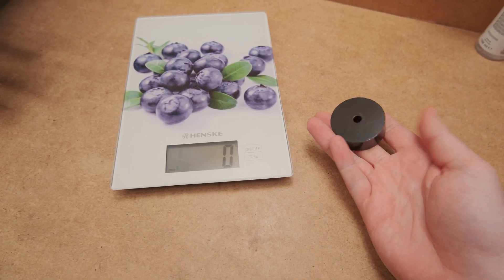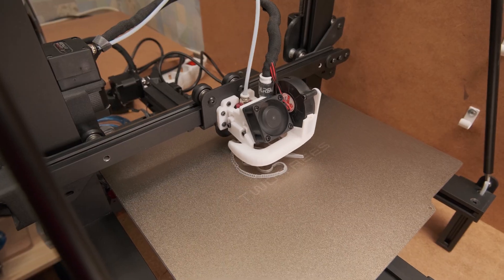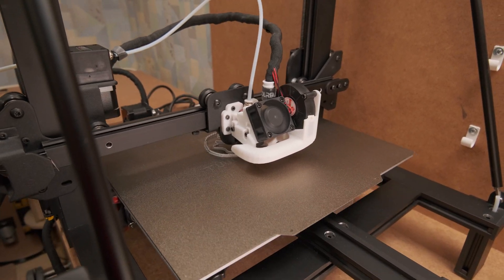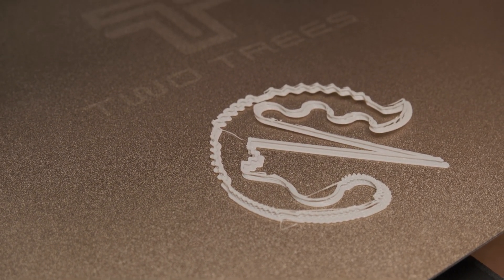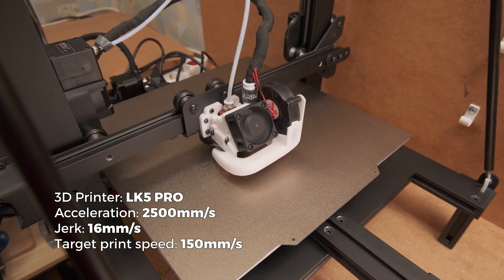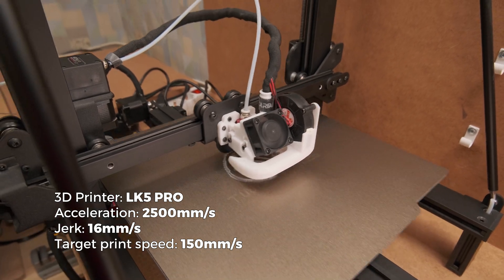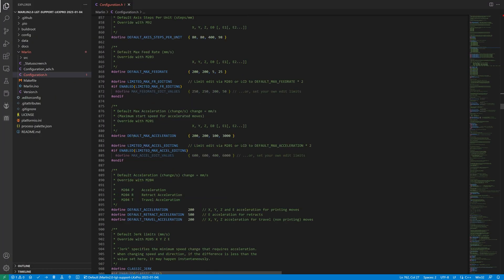And for the weight difference, we do an additional test to see if this insignificant amount makes it worse. Another thing we need to figure out is our 3D printer hardware limits, as upping acceleration and jerk settings can easily introduce stepper motor skips and produce layer shifts. The safe limit for this big printer was 2500 mm/s² acceleration and 16 mm/s jerk values. Far from groundbreaking speeds, but considering the default acceleration in the firmware was set to 200 mm/s², I would say it is a big step forward.